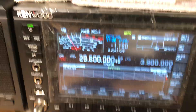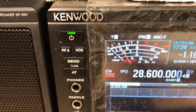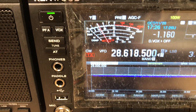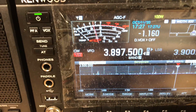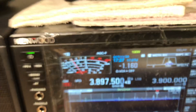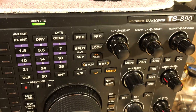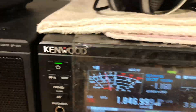I'm going to do some more electrical engineering to figure that out. But for the most part, I just want to show people it is working and I am a happy camper. On 10 meters — it's found a tune. It's 1.5; if you're playing around you've got to jockey it around a little bit. Once it finds a match, it stores it in the memory of the tuner out there on the tree. Really good match on 80 — that light goes out, SWR basically 1 to 1. I still have my plastic screen on my 890, never took it off — just gives me the feeling that it's still new. I think this is a successful project, working out really well. Hopefully this push-to-talk is actually really closing — could be some RF grounding issues, but that's something for a different talk show.